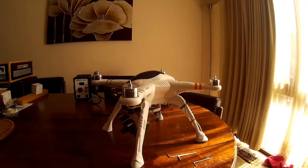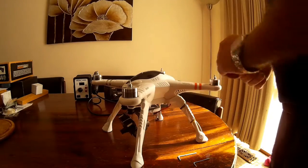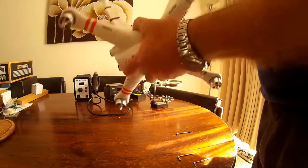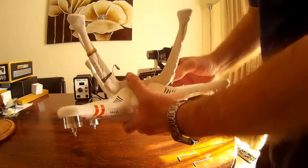Don't forget there's also one hidden right here — there's a little rubber cup. You can easily miss that. If you do forget to take it out and try to split the frame apart, you could shatter the frame in that region. So just bear that in mind — you've got to get it out before she goes bang.